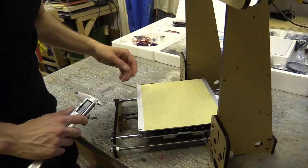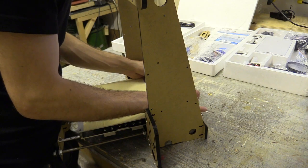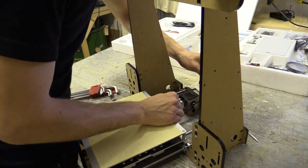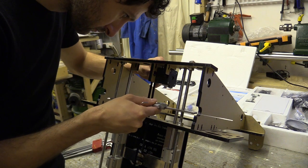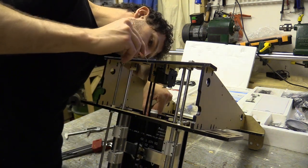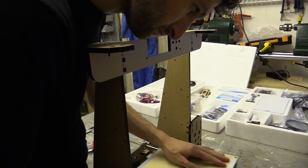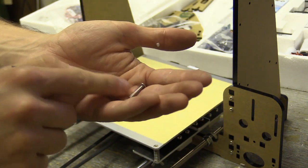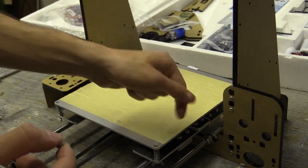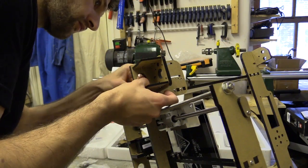A week later — I'm just going to make sure the belt lines up. The pulley has been put on quite to one side and it doesn't look square or straight to me. I've actually got some flanged head machine screws — these are just a little bit wider than the mushroom head machine screws I've been sent. I think they will hold a bit better. They are a little bit shorter — 16mm versus 18mm — but they still hold the nuts.